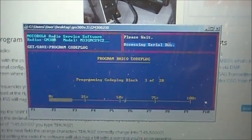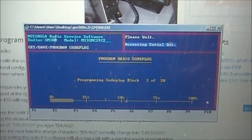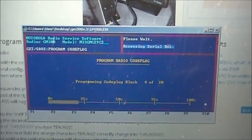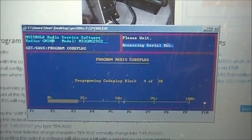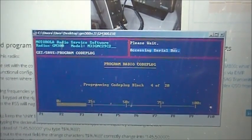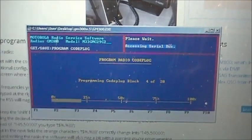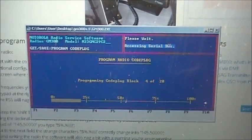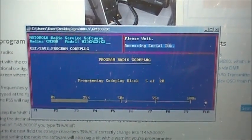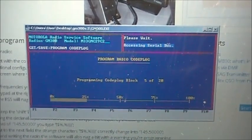I thought I'd throw that in there. So the radio is programming, and right now there will be two channels on the radio. Channel 1 is going to be 144.390. Channel 2 is going to be 145.010. Channel 3, I think I'm going to put 145.800 on there — just a couple of the International Space Station packet frequencies. I'm just making sure these are actually going to program, and once she's done programming the radio we'll verify it actually popped up.